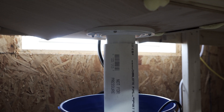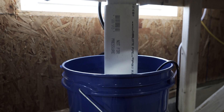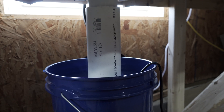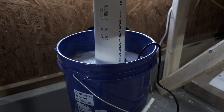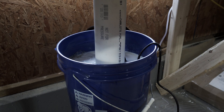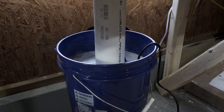Inside the coolant bucket you can see it rippling a bit. I don't think I'll be using coolant super often — certainly not as much as an actual shop with an actual CNC. So to keep it from getting too gross, I have a little aquarium aerator bubbler in there to help churn the surface up, hopefully keeping bacteria down so I don't have to replace it too often. The oil is not super expensive but not super cheap either, so I prefer not to waste it.